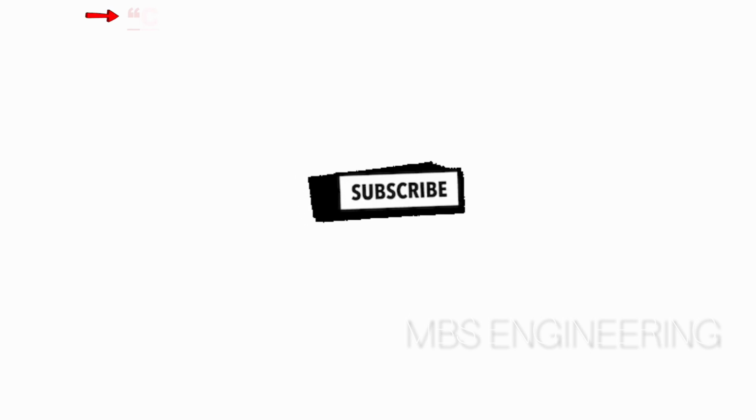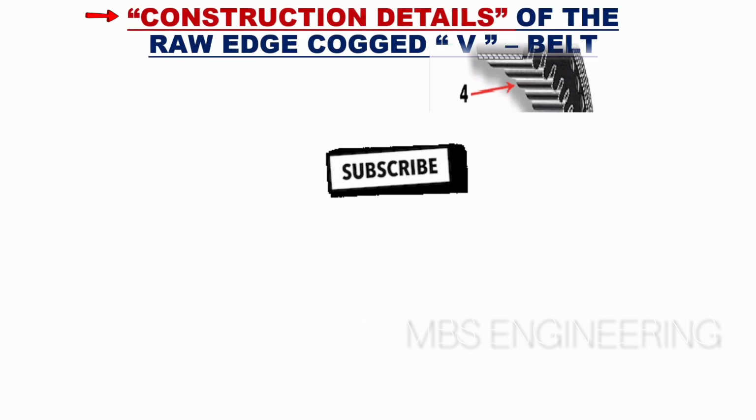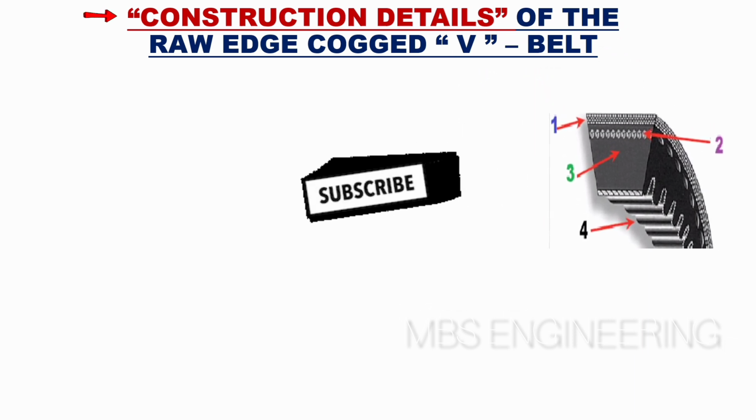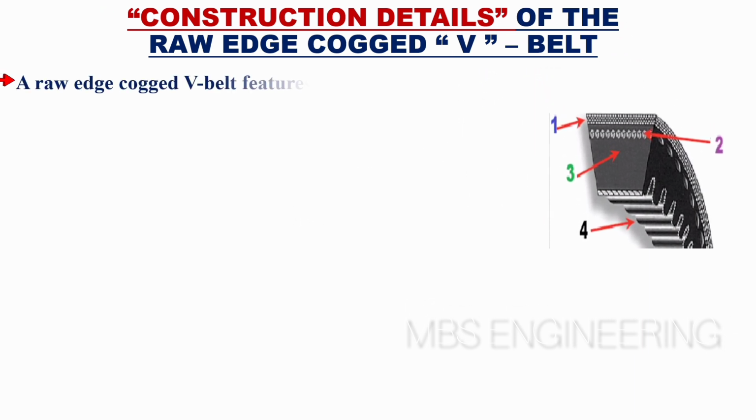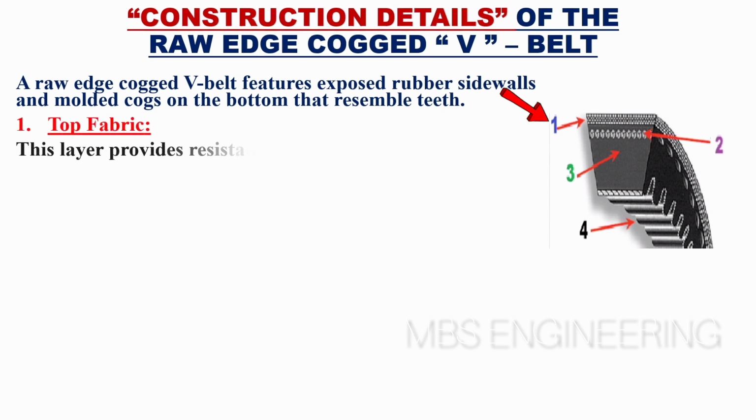Next, we will learn about the construction details of the raw edge cogged V belt. A raw edge cogged V belt features exposed rubber sidewalls and molded cogs on the bottom that resemble teeth. Please refer to the picture of the raw edge cogged construction details. The first construction detail is the fabric. This layer provides resistance to heat and oil. The second construction detail is the load carrying section.